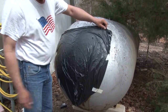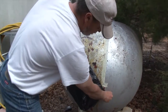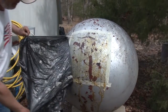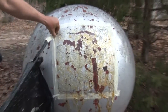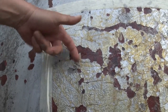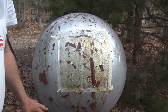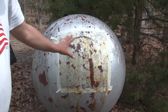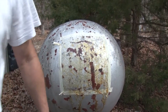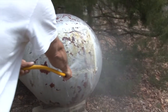We've had a little rain delay, so we've left this on a few more hours than normal — had some pretty good storms. Now we're going to take the cover off. There's what she looks like when it's de-bonded — it's actually just peeling off. If we had a pressure washer, you could take that and remove it easily. But since we don't have one set up for this small area, I'm just going to run water on it to help de-bond it, then take a light scrub brush and take the paint off. Just pressure with my finger and you can see it peeling.